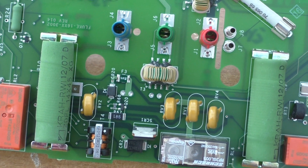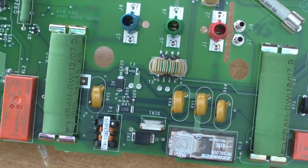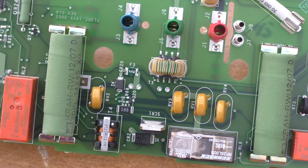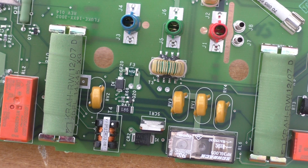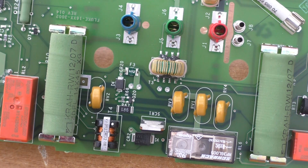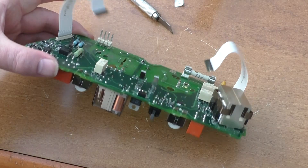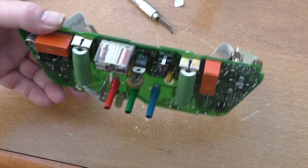After tracing components through the board, I found another fuse — a PCB-mounted fuse, F3, on the bottom board. I've checked that fuse: fine. I've checked all the coils, all the transistors, and pretty much everything else — just got some caps to check. Everything seems to be okay. It's a multi-layer board — I think three layers — and I've checked it for flexing and traced tracks through. Best thing now is put it back together and move on to the middle board.